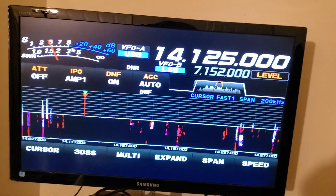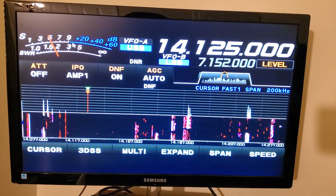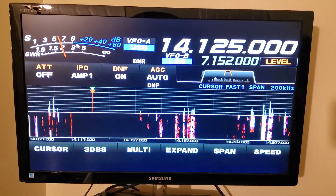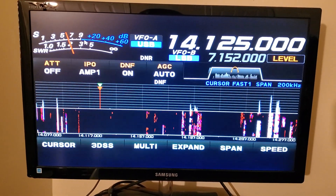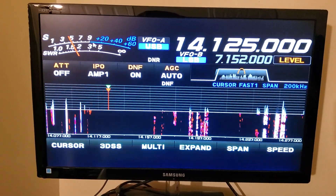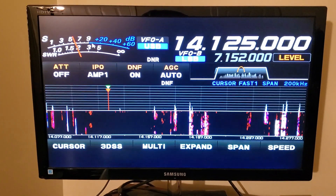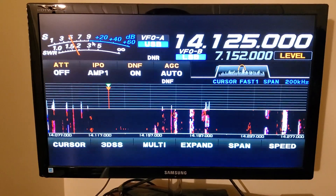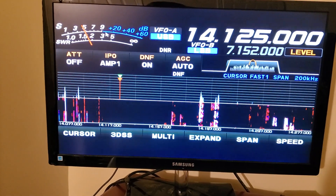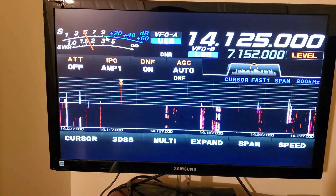When I'm trying to make some DX contacts, which is what I enjoy doing, I keep the amp on up to 20 meters. I don't use the amp on 40 meters but I do on 20. Prior to this, with amp one on, a lot of times it can settle out around an S4 noise floor, which is good, because I was getting good signal reports from Europe. I live in the southeastern United States, and from Europe I was getting signal reports of S8 and S9. But my noise level was running about S7 to S8, so they could hear me loud and clear but I could not hear them because of the noise.